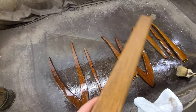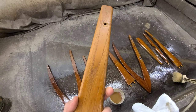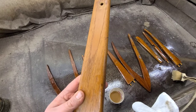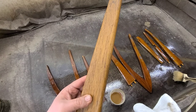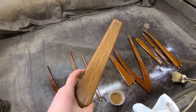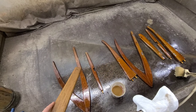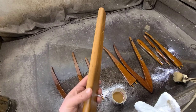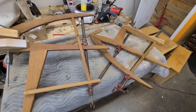QCS has a slightly oily look as it's drying but it won't contaminate the wood — especially since you'll be sanding afterward. I'll also wash it with a little water to get any residue off. It may weep out a little longer than a methylene chloride-type stripper, so give it an extra day to dry out in a warm area, then wipe it down with water. It works especially well on Scandinavian furniture with oiled finishes, washing them right off and reducing the need for excess sanding.